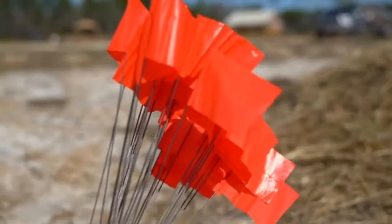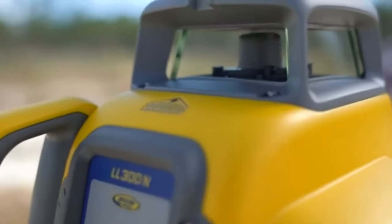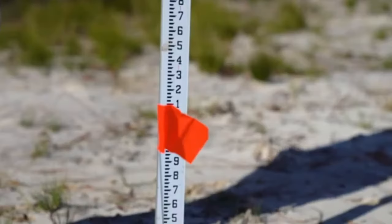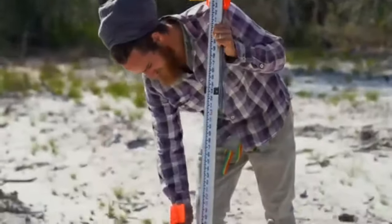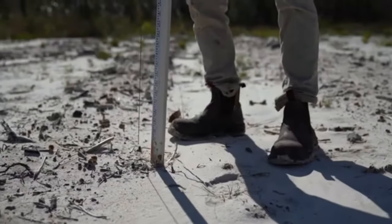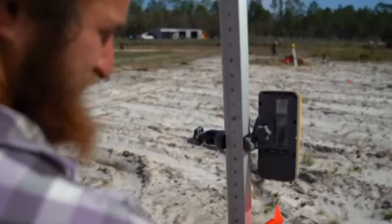First things first when you're starting a swale is to determine where the swale needs to go. From there you'll take a transit — there are other tools too, like a bunyip level, which is a water level, and also an A-frame. I prefer a transit just because it's easier. You'll mark out your contour line, and there are many determining factors. Sometimes you're starting at the lowest point on the highest boundary, giving you the longest highest contour line and water catchment feature. Sometimes you're starting at the highest point on the lowest boundary, giving you the lowest longest water catchment feature.